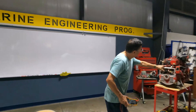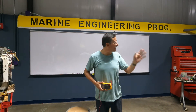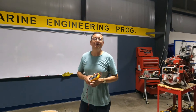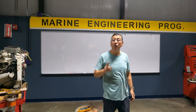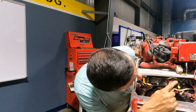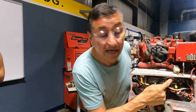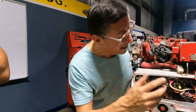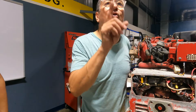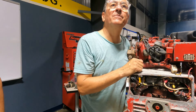In the main breaker, what cables do you have? Hot and neutral. What about the ground? The ground comes from the body of the generator. Neutral and ground are connected together only at the source of power. From any part of the generator housing, send a separate ground. The only point where neutral and ground are bonded together is at the source of power.